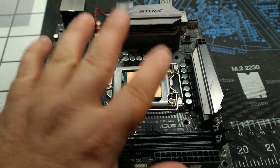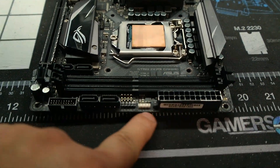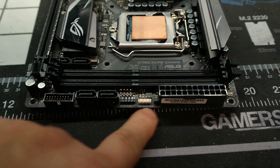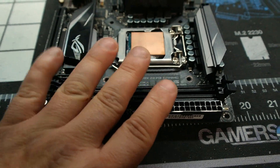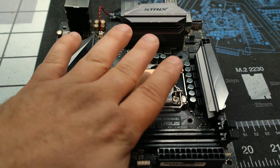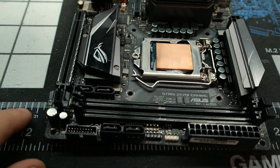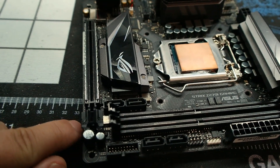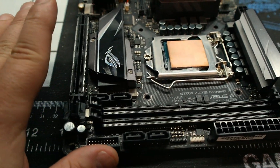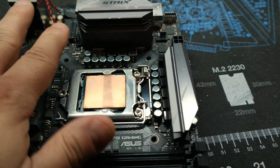The motherboard started up, didn't do anything, and it has a row of LEDs underneath here. It was lighting up for about 15 seconds, and then that's it. If you try turning on the power now, it doesn't do anything other than pull 35 watts, and there's a little amber LED off to the side that says it has power — and that's all it does. Doesn't post, doesn't do anything.